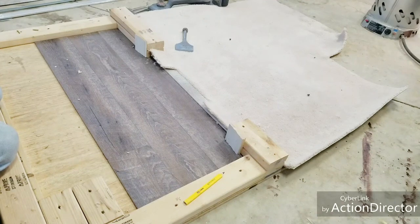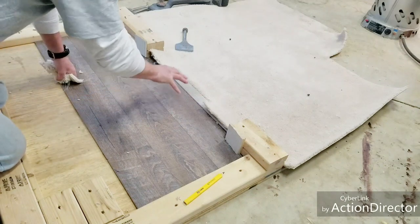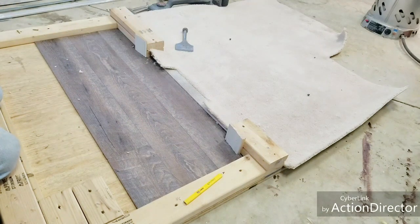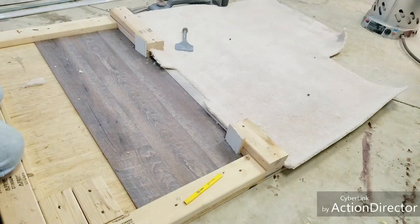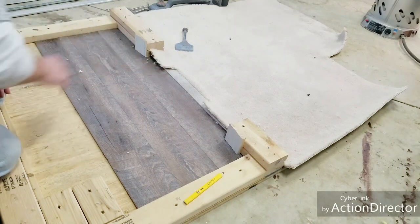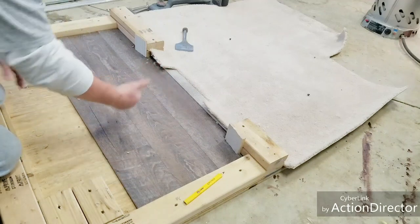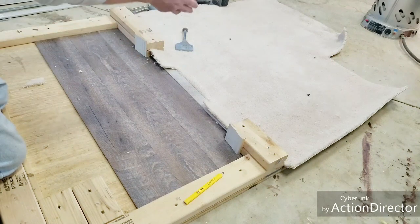You've got a good quality product here. Again, this was just an arbitrary color. If I were using this, I would be getting a molding that exactly matched the floor. And again, you've got the performance properties that the floor is going to have. I will even go so far as to pre-cut this piece before I have the floor installed, because part of the beauty of these new floors is that you're going to get a lot of coloration, a lot of variation that adds to the realism. From one plank to the next, it may change significantly, and I want to be able to put this in place and then pick and choose what plank goes next to it. That way I can blend it to my molding. I make the floor match the molding, not trying to make the molding match the floor.